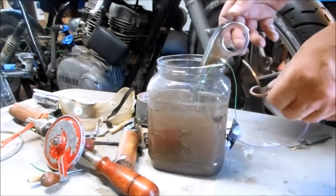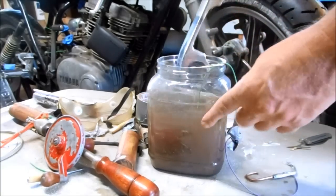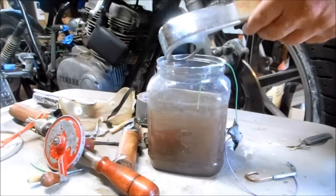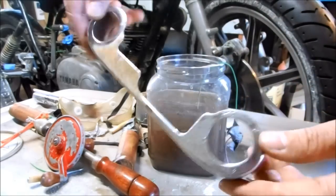I've had the current on this since yesterday, and the electrolyte is just horribly filthy. But the part looks really good — check that out. The rust is gone.